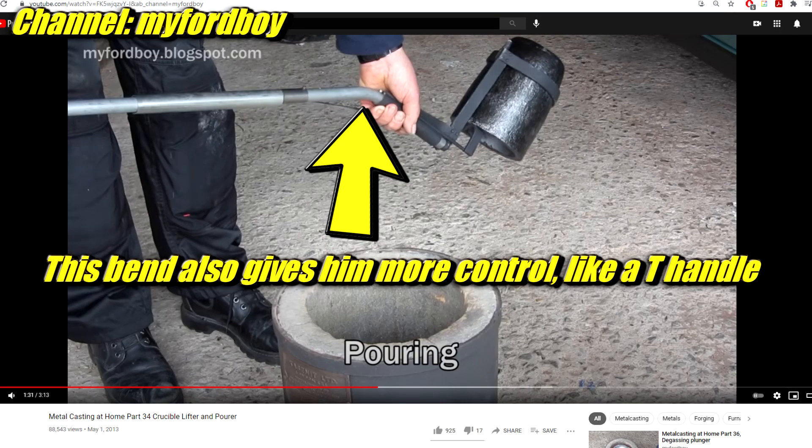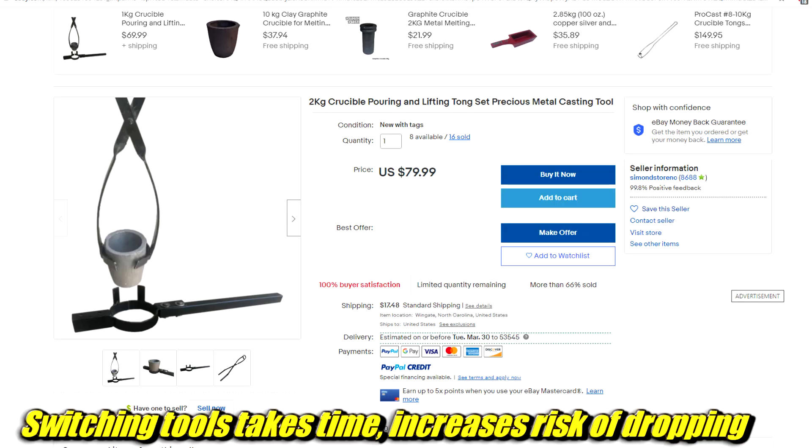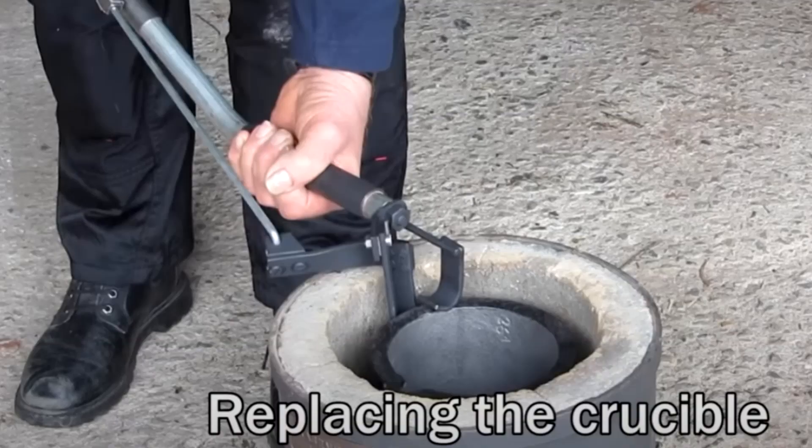It's a little too complicated for my purposes though — not in concept, but I'm going to make the thing, and if I have to make something complicated it's probably not going to work. So I'm going to try to simplify it. I want crucible tongs that I can use with two very similar but not exactly the same size crucibles. They're pretty big so I might have to lift a fair amount of weight — though probably just aluminum, not copper or bronze. Weight is a factor but not a huge one. I'm not going to need wheels or a second person. I kind of don't want separate tongs and shank — only one contraption — and I don't want more than one hinge. It would be nice if there was just a stopper on the top to hold the crucible in, not just clamping pressure from the jaws but not a separate twisting hinge locking mechanism.